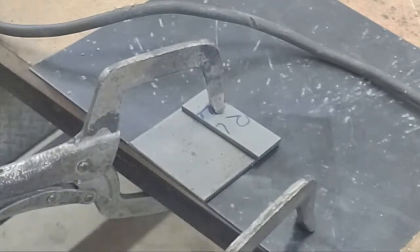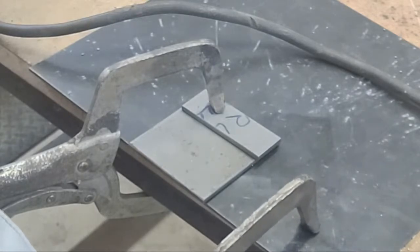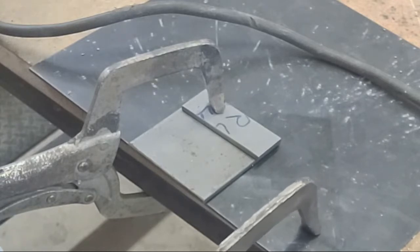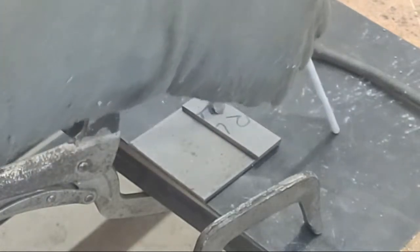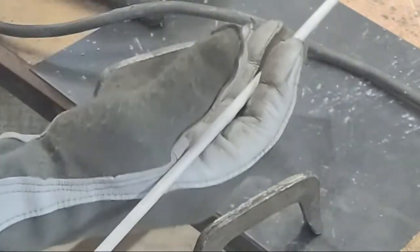Martin Dean wants to know: do you have a plasma welder? I do not have a plasma — the plasma is a plasma cutter. A TIG welder or heli-arc is a TIG welder. When we talk about plasma, it's like a thermal arc. Once you start a puddle with the plasma and get it red hot and molten, the air coming through the plasma blows that metal out of the way. That's why when you cut something with a plasma, if it's relatively thin — eighth inch, whatever — you can pick it right up if it's not hot.